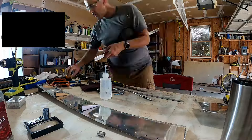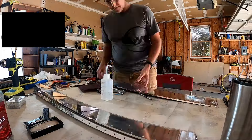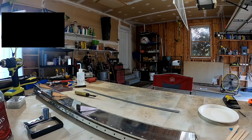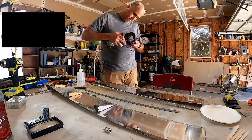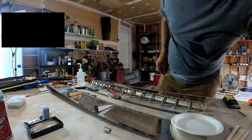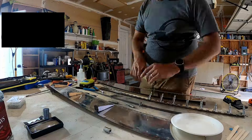Here's me dimpling both sides of the spar by accident, because you just think you know how to do it. Of course you don't - you don't dimple one side of the spar because one side goes into the hinge. So I had to go back and undimple it. Such an idiot. You countersink it with the hinge in place, and I used a flat squeezer to undimple that whole side.